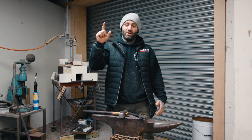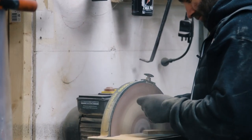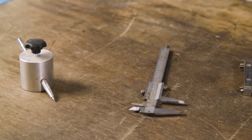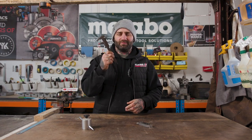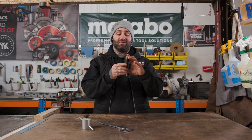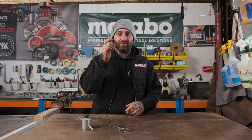Now let's look at some of the smaller tools I use every single day. A centre scribe for marking the centre on knife blades before I grind them — especially if you're free-handing, you want to know where the centre is and where the meat point is. Some really cheap but good calipers that I've had for about five years — good for checking the thickness before you mark the centre, and also marking the bevels so you get the height right on each side. And then a file guide, which keeps the bevels nice and even at the plunge, and also when you're filing the hidden tangs — it keeps all the shoulders nice and even, making everything a lot more accurate.